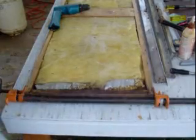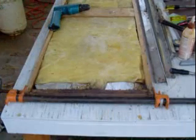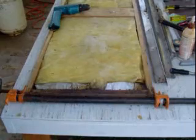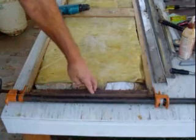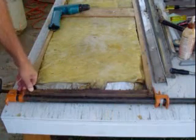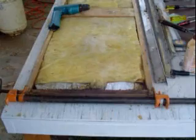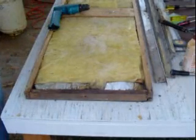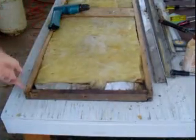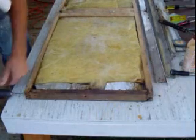The only place where we had bad framing in this door really was at the bottom, of course — that's where you'd expect it. And there's really nothing wrong with this wood here; it just came separated on both ends. So I sanded off the ends a little bit, cleaned them up and used Gorilla Glue — remember the good old Gorilla Glue? And clamped it together here and left it overnight. It's nice to have these bar clamps. That's good and solid. So I'm going to put a screw in each end, and then we will put the new skin on the door.